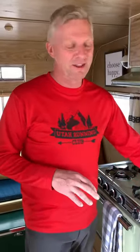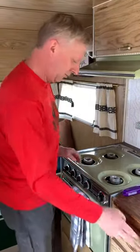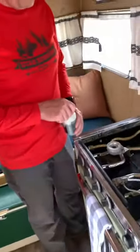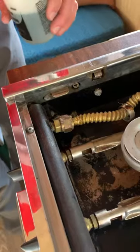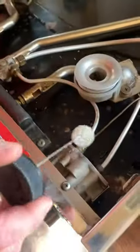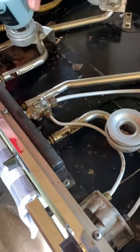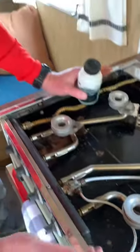I come in and smell — I don't smell any propane. I've had it on for a little while, but before I light anything up, I'm going to test all the fittings. I'll start with the stove. Most of these stoves just come right up and off. This is where the gas comes in, so I'm going to test this fitting. You have to let it sit for a second because some leaks are really slow. No bubble there. Remember, it's not the little bubbles — it's a big bubble. If there's propane leaking, it'll make a big bubble and pop. Usually all I've had to do is tighten the fitting and I've been okay.